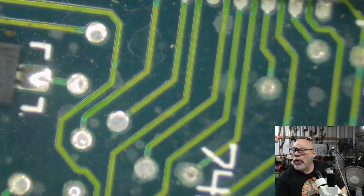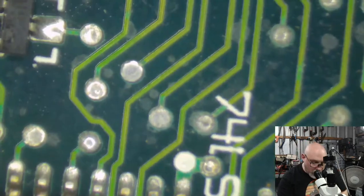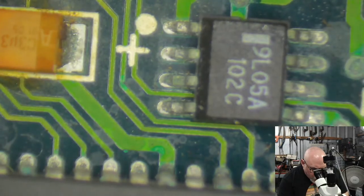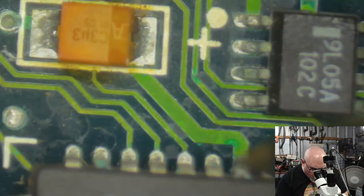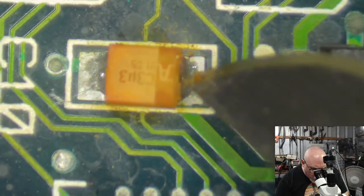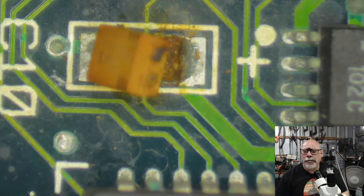Do the connections on the yoke look good? Would definitely look under the RF shield. Yeah, I will look under the RF shield. The yoke connections look pretty good, so I wasn't overly concerned. I certainly didn't think that was an issue, but I will definitely look under the shield. Wow, does that capacitor look kind of cooked to you? I'm glad I spotted that.